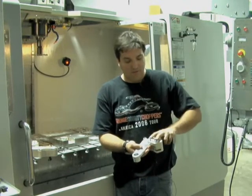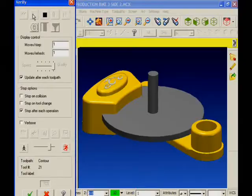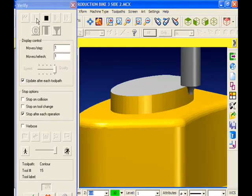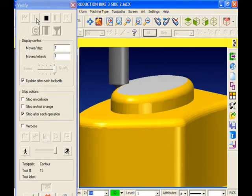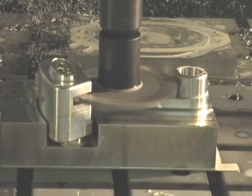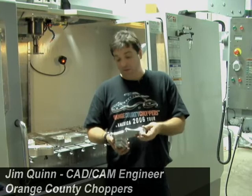When it comes back, we'll install the bolt and the key switch, ready to put on a bike. This particular product was designed completely in Mastercam, programmed using Mastercam, and uses several different machining applications. We're using pocketing, some undercut contour milling, boring, drilling, and contouring. So we really put Mastercam to use on it, and the parts that are coming out are coming out wonderful.